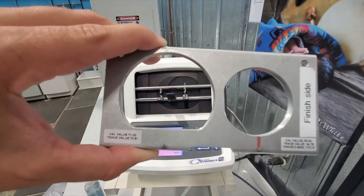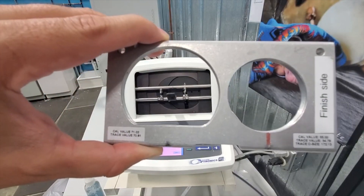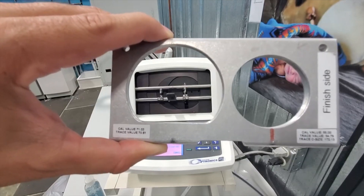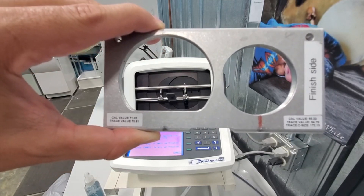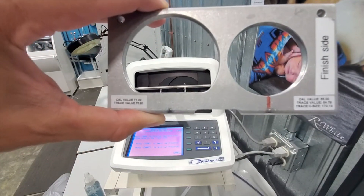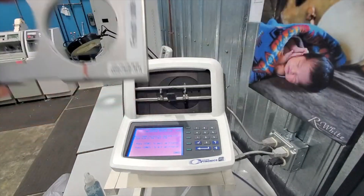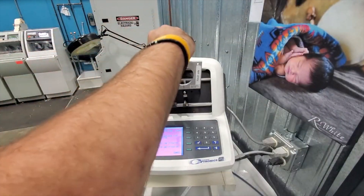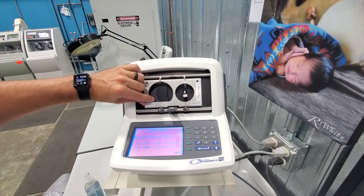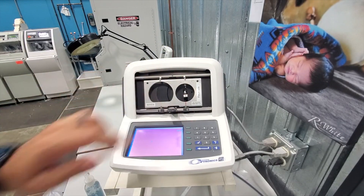You'll also see on the right side there's a notch on the bottom of the circle. We've highlighted it red just to make it a little easier to see, but there is an actual notch in the metal there, which you're going to use to help line up with your clamping studs. To start this, we'll go ahead and open up our clamp, insert our tool, make sure that the notch is lined up with the clamping stud, and hit start.